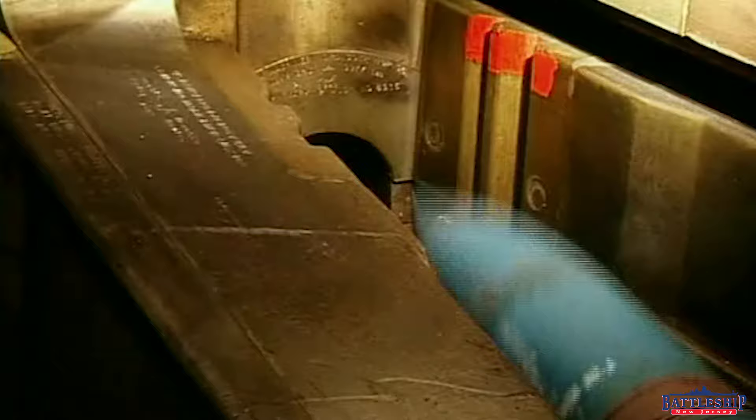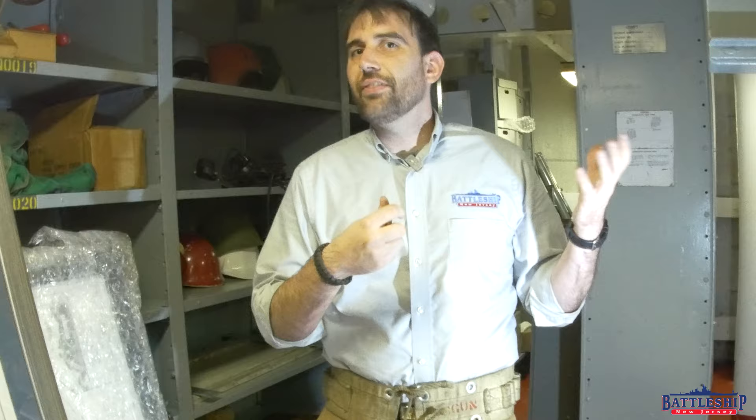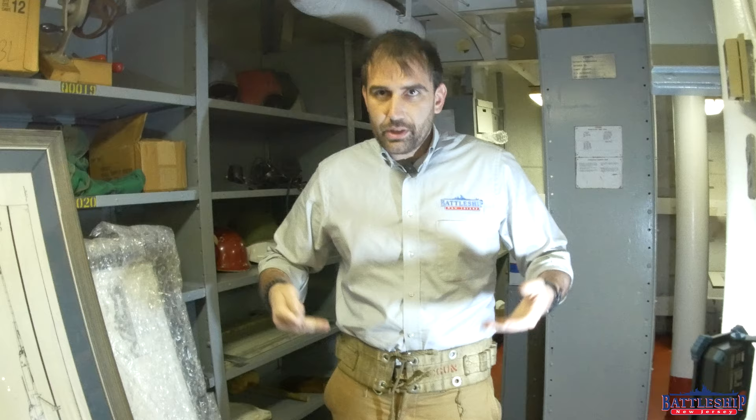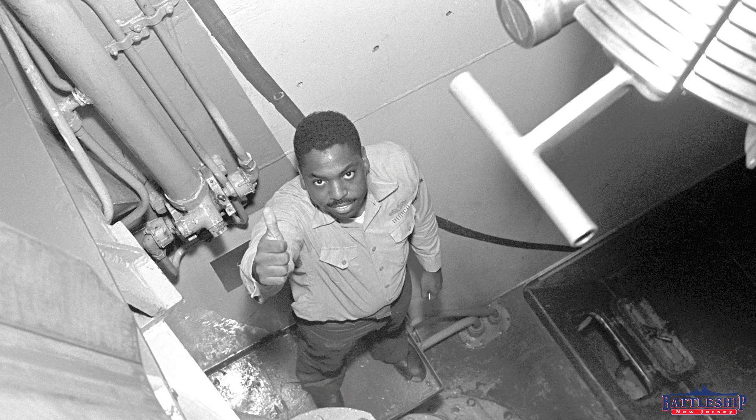It's bag guns. The five-inch guns use a brass or sometimes steel or aluminum casing that has all the propellant in it — it has a primer built into the base so that a firing pin can just strike that primer and fire it. The 16-inch guns, the powder for them is stored in silk bags. There isn't any sort of ignition source there, so the breech of the gun has a hole in it for a primer like this to go into. One of the sailors in the 16-inch guns is to wear one of these belts and stand in the gun pit below the gun.